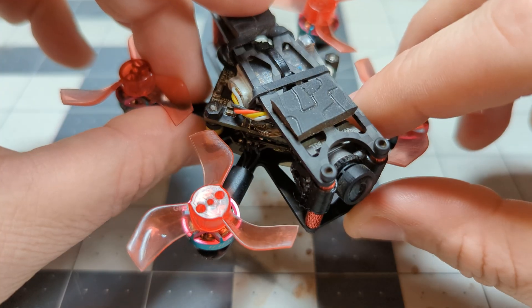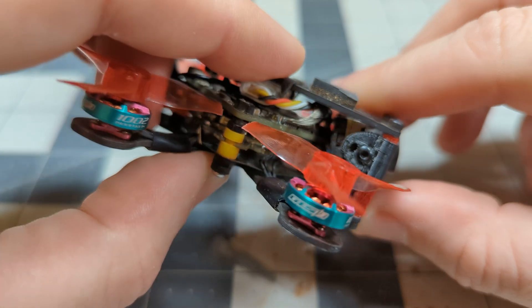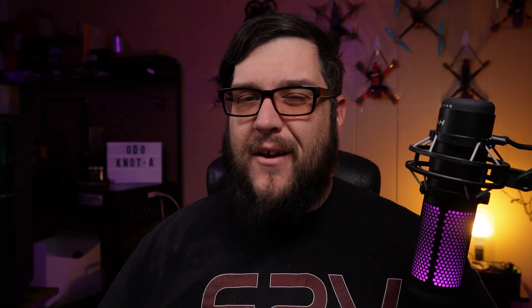There are some challenges — the antenna is actually pretty hard to find a mounting place for, and the camera kind of runs into the stack, so you can't get a whole lot of angle out of it. I'm getting probably around 15 degrees, but it's totally flyable. I did have to print some different camera mounts, because the ones that come in the parts bag from Armitan are made for a very specific camera. So if you're planning on putting a Walksnail kit or the HD Zero whoop light kit in yours, you'll probably have to print your own standoff mounts for your camera.